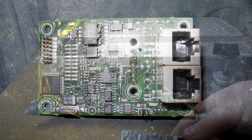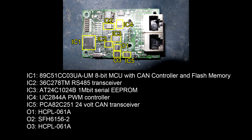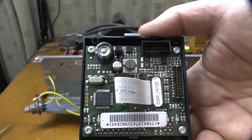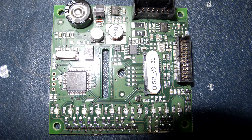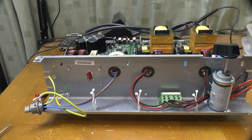This is the RS485 board. Here's a close-up with the list of ICs on it. Interestingly, although the connection to the outside world is RS485, internally it uses a CAN bus system — the sort of thing you find in modern cars among other things. The front panel unit has the same Atmel processor and a small supercapacitor. There are no component numbers on the board so I've made one up just for the ICs so you can see what's what.